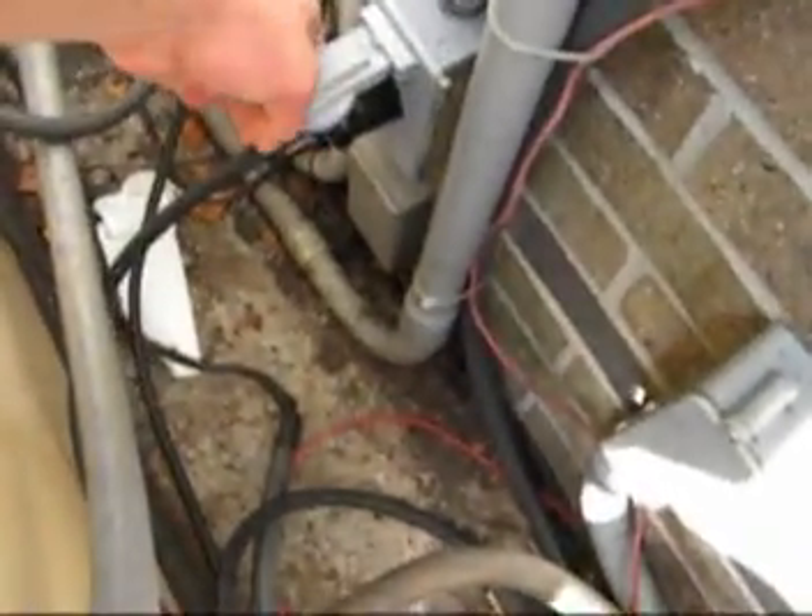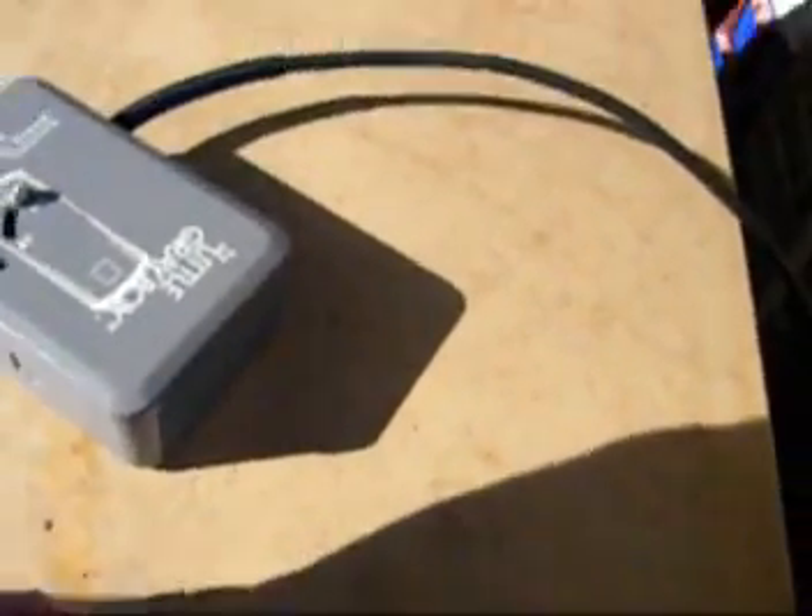As you can see, that's the 240 — that's actually a 230 outlet — and this is coming out of my main breaker box, and then basically this generator goes in on a transfer switch. So right now I can run it off grid power or run it off the generator. But the idea here, of course, if power's out, you're running a generator. You don't want to run it all day long because it takes a lot of fuel and money, so you run this to do the high loads for an hour — cool the house, and so on. In the meanwhile, you'll be running this system here.